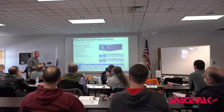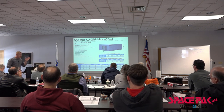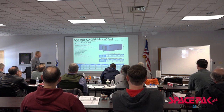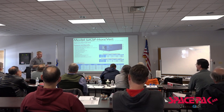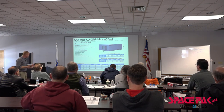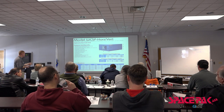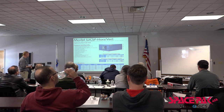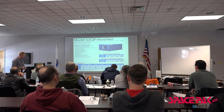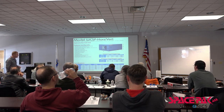They come in three sizes, the same 2430, 3642, and 4860 from that 2-ton all the way up to 5-ton capacities. Virtually exactly the same size with the same benefits, the same field conversion for 110 volts, the same, obviously, we're heat pump compatible, but we still have a big fat 6-row hydronic coil. Our float switch, our condensate trap, all of that stuff still comes into play.